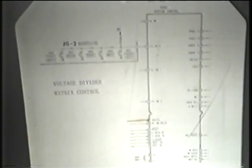All right, page 28, you see here that when an insert edit is being performed, the control track is never altered. Well, we've already covered that. We need to maintain the control track if we want good clean edits in the insert mode. For assemble edit, it's not important.